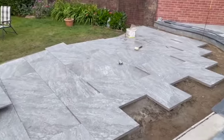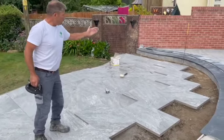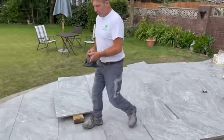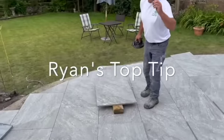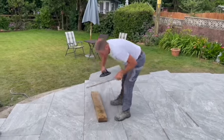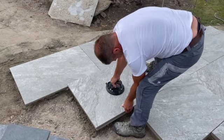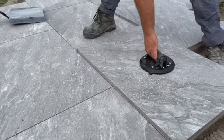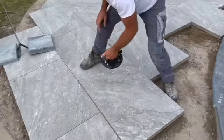So as you can see we've got the slabs lined on there. What we do is every alternate slab we're going to mark and cut. We'll mark it all first, all the way through. Ryan's put the spacers on the top here - spacers all in between. What we want to try and do is get the correct gap using the spacers we're using. Some people think this is a bit excessive but it's just about good practice - we can use the spacers to pull in and get it right.